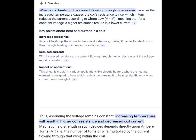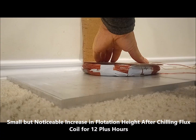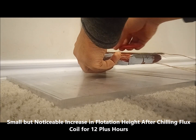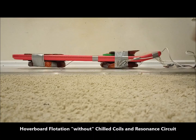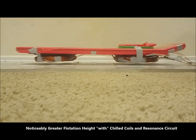Another factor is atomic heating as it pertains to current-carrying conductors. As the coils become hotter, resistance increases due to increased internal atomic vibrations which hinder current flow, and this mitigation of current drastically reduces flotation height. Placing the coil in the freezer overnight and again activating it with a series capacitor resulted in an additional 20% gain. This gave a total of 80% greater height at cold temperature with a series capacitor compared to room temperature with no capacitor — and actually closer to 100% greater upon first activation when the coil was at its coldest.